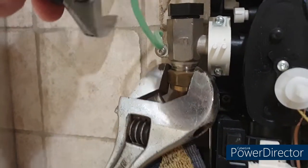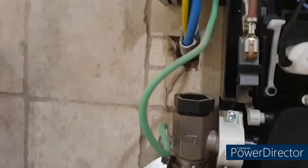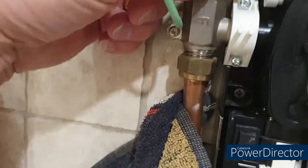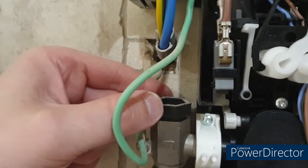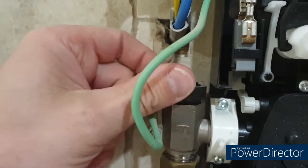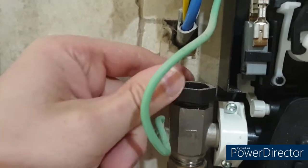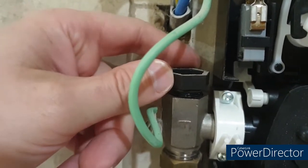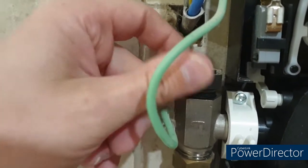We will loosen off the large plastic nut — be careful with it, you can hear a little bit of water hissing. Loosen off the large plastic nut and make sure your spanner doesn't fall off and crack the tiles. You can take it out with your thumb and forefinger, and hopefully in here I'm hoping to see that this is absolutely blocked.